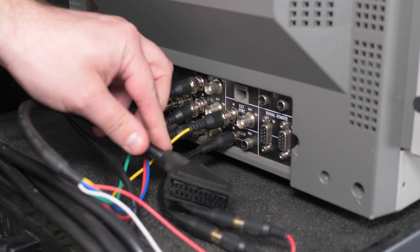Splitting is easier to think about. You have one output that's meant to drive a relatively high impedance — we were emulating it with 100k resistors. If you split it so it drives two inputs, that's like 200k combined resistance, which gives you around 50k effective, still within the normal operating parameters of the mono output. It can probably even drive a few more inputs — no issues there.